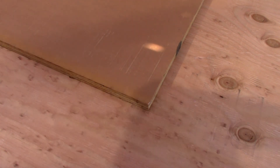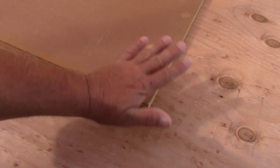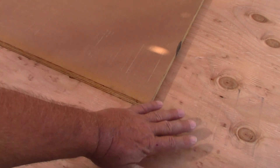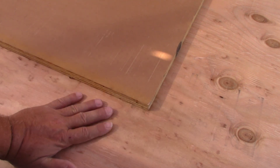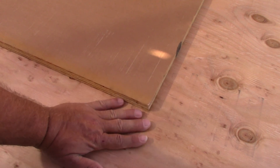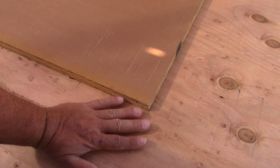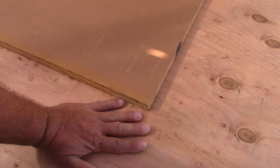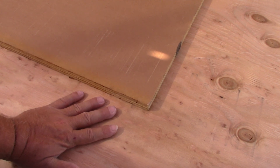It's always worth checking the thickness, but it's going to be a nice stable tabletop for my CNC. This piece down here is going to be the actual CNC tabletop. Because I live in southern Oregon, I need to coat and finish this plywood before I assemble and mount it on the frame. I'm going to give it three coats of polyurethane just to seal it before I put it down, so I don't get any unpleasant surprises later when the wet season comes along.